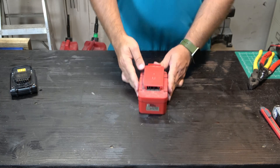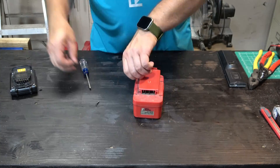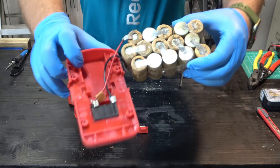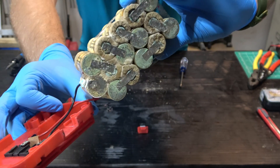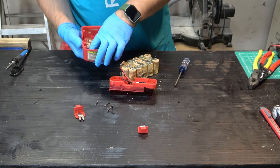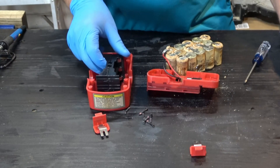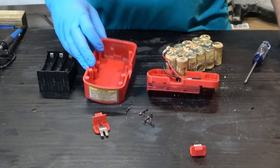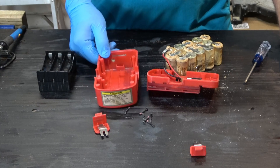First, let's take this one apart and see what it looks like on the inside. I got it apart, and you can see that the NiCAD batteries are leaking. I was hoping we were going to be able to fit 10 cells in there, but because of the strengthening tabs and the screw inserts, we just don't have room, so I'm going to have to only do 5 cells.